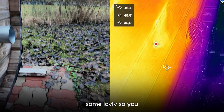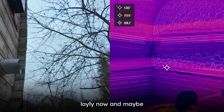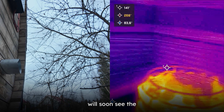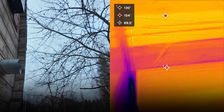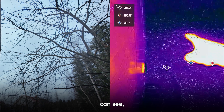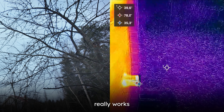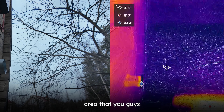It's now way too aggressive — the sauna will get really cold with this kind of pressure. But you can physically see the air moving from here, and especially after you throw löyly you can see how it starts slowly coming out, which means it circulates all the air inside the sauna. Now the löyly starts coming out from the other side — it's just now starting to come out after having circulated through the sauna. That means the mechanical ventilation really works.